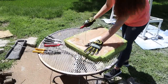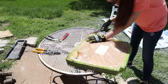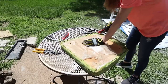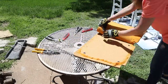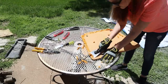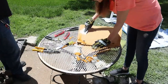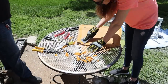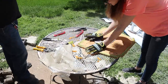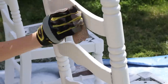While the chairs cured in the sun I started working on the seat cushions. I used a utility knife to cut the fabric off the base piece, and needle nose pliers helped with that process too. I removed the fabric and all the foam and scraped off the adhesive. I wanted to reuse the board base piece to reupholster with new foam and fabric — it also made reattaching easier since the anchor bolt holes were already there. The cool thing we found was a little piece of paper on the bottom; we believe these chairs are from the 1920s based on the information printed on it.